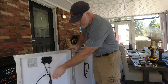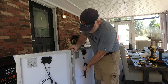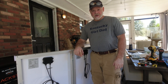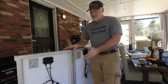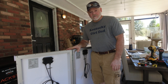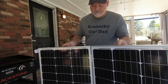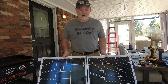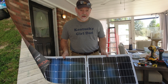All I have to do is parallel these together — I don't have the Y-cords with me right now, but parallel those together. Then pair my SP-200 solar panel with these in series. This will run my AC200P, it'll run the EB150, and we'll have 400 watts of solar panels total. I'm going to show you it in action here with the SP-200 and we'll see how many watts we're getting out of them.